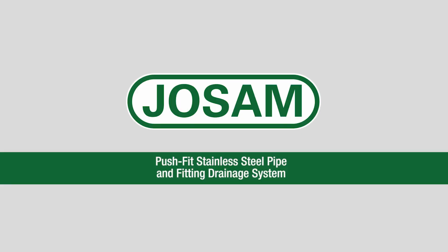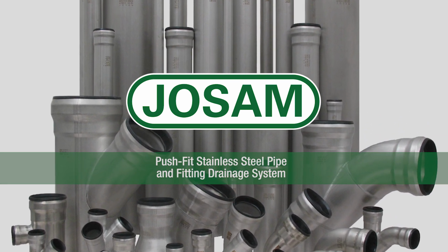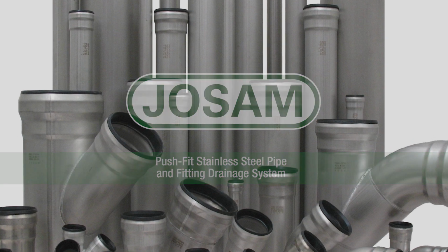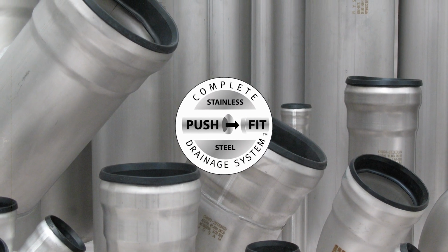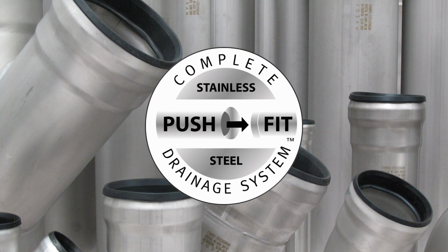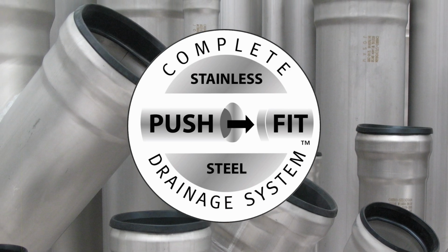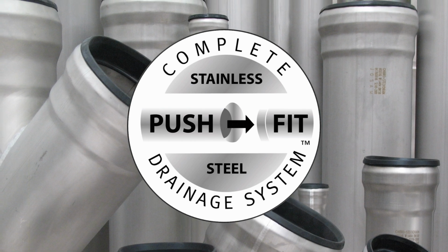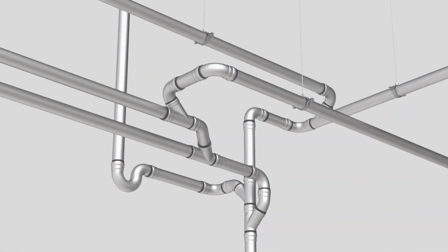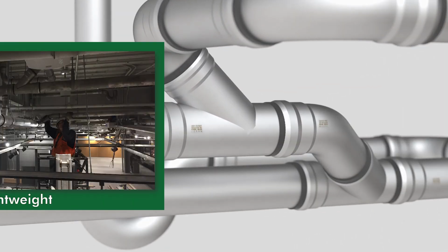Years ago, Josam Company was responsible for introducing the first push-fit stainless steel drainage system into the U.S. market. Today, Josam's second-generation push-fit system includes a heavier gauge with higher test ratings and no special cutting tools. The emergence of Josam's push-fit system has enabled installers to obtain all the benefits of stainless steel while reducing overall installation costs. Josam's complete range of push-fit pipes are available in Type 316L austenitic stainless steel.